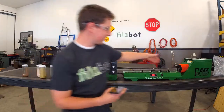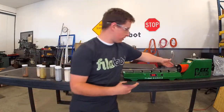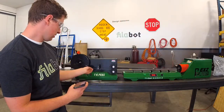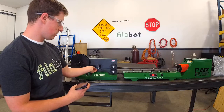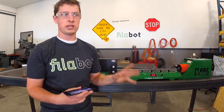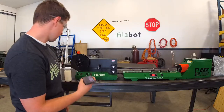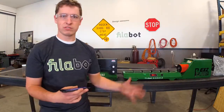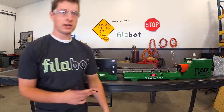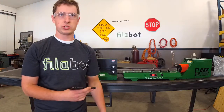You can see that the system is making filament like normal — comes out of the nozzle, goes through the air path, cools down, and onto the spooler. The filament is a little more rough than normal; we're still playing with settings. We got this material this week and we're going to be playing with it — playing with different additives and different mixture rates.